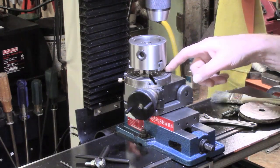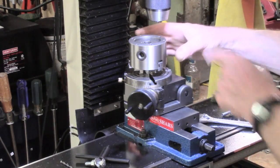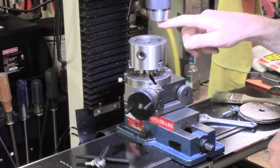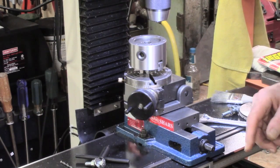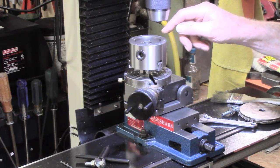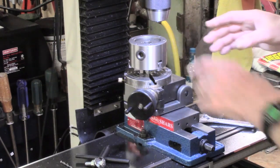I've got back to the rotary table setting up the chuck. I've had this locked onto the centering pin, and I used the closest I had that I could get in because of the lack of space — I think it was a number two centre — and I managed to eyeball that in X and Y directions to the point where it is extremely close.